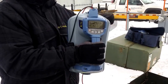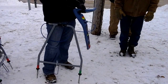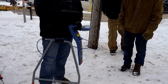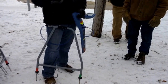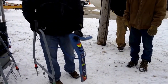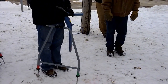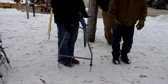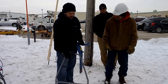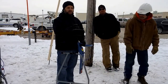The ground rod is good — it's making noise letting me know it's completing a circuit. On the A-frame, when you plug it in, it will set itself up automatically so you don't have to worry about what mode you're in. Just get it plugged in correctly, you'll hear it beep, see the arrows show up on screen, and you're already picking up decibel readings. If you want to locate the line while doing fault finding, hit the right button and it takes you to locate mode to pinpoint where it's at, then hit it a couple more times to get back to A-frame mode. You don't have to be directly over the wire — you can be off to the side 2, 3, 4, or 5 feet. If there's concrete right where you want to be, get over to good ground and get good ground contact with those spikes.